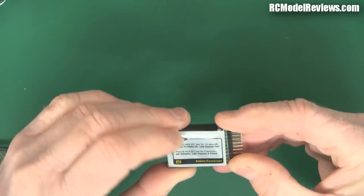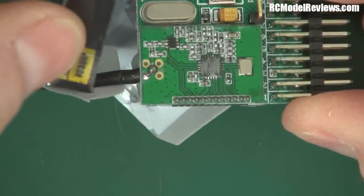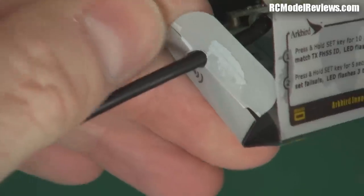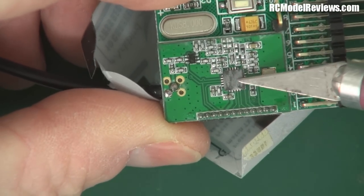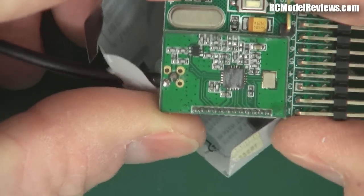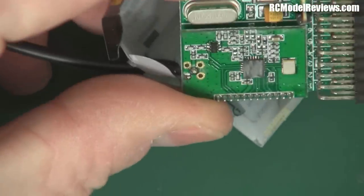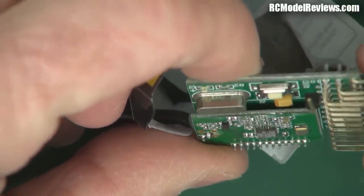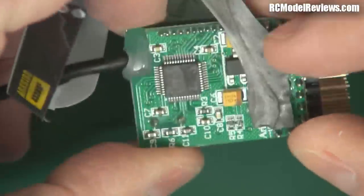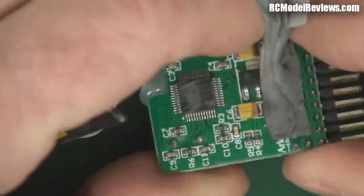Let's peel the plastic off and have a look inside. The Arc Bird is a great idea but so far I'm less than impressed. Getting the case off is awkward because the cord goes through the hole so you can't remove it cleanly. Inside we've got the same module-based approach again — a little circuit board, a daughter board — and again they've scraped the markings off. That's almost certainly going to be the Silicon Labs chip used in the Easy UHF system, but I'll have to check the pinouts. And look — they're using an old-school crystal! These are so fragile compared to surface mount components. This is 1960s technology. On the back it's a double-sided load with a processor, and again, the markings are scraped off.